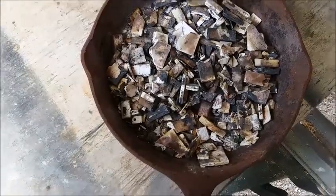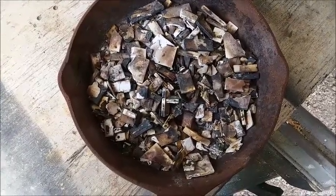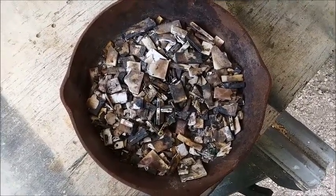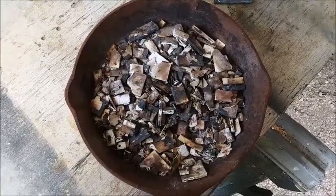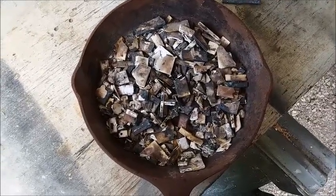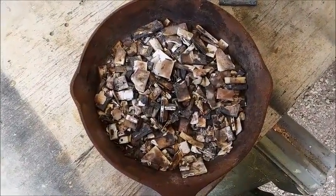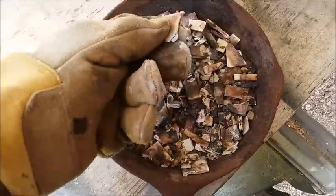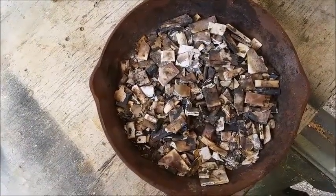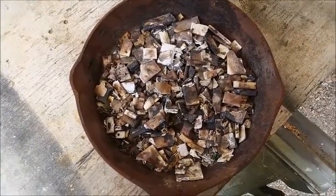The blender will make short work of them — it'll be a fine fluffy powder that I'll be able to wash off the metal bits with water. I could get my mini sluice out rather than panning and run all this stuff through, which might be a lot quicker especially if I get two or three loads done today. Anyway, I just wanted to show you how I've improved my method of pyrolyzing — and actually in this case oxidizing and ashing — IC chips before processing them for the gold they contain. I've been doing this for a while now and it makes it a whole lot easier to get the gold out. There's just so much less carbon to deal with, and that is a beautiful thing. Thanks for watching — keep it safe out there.